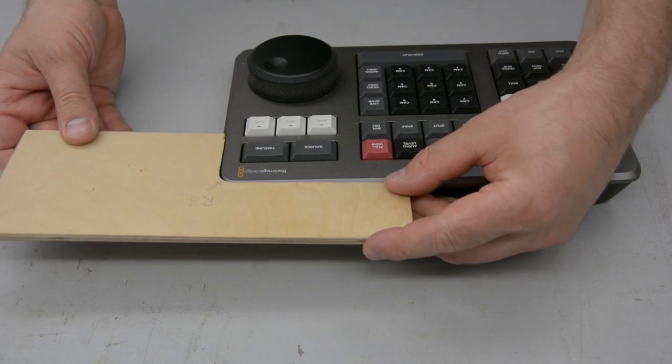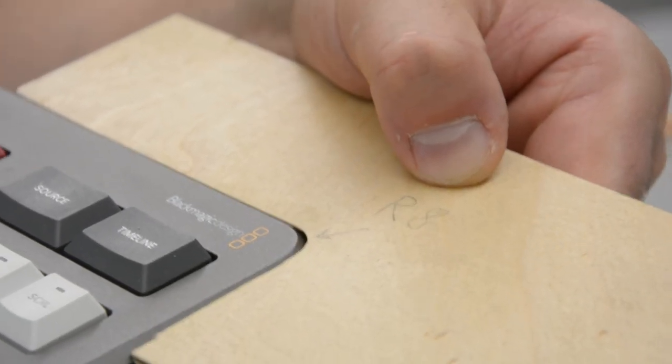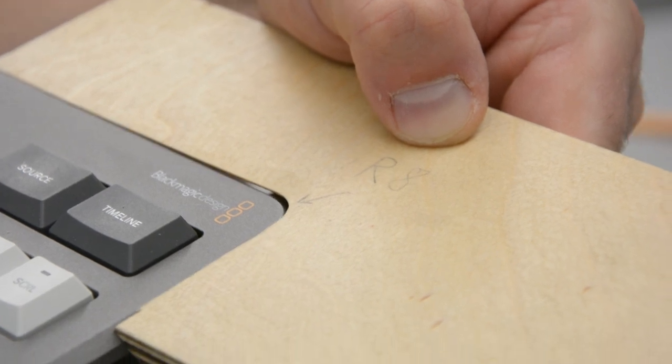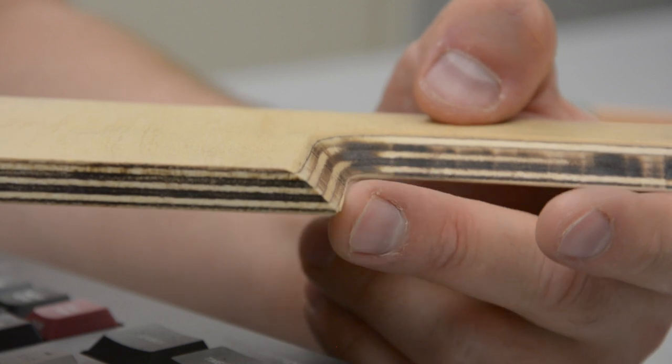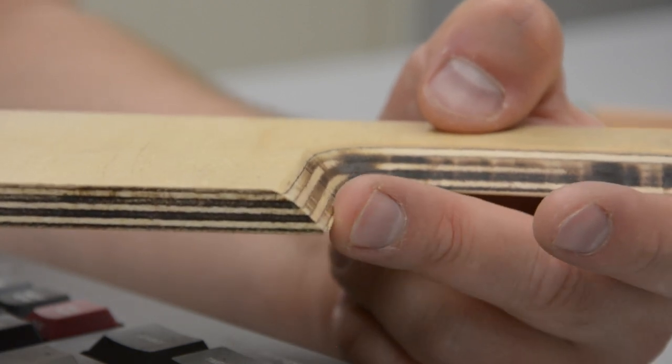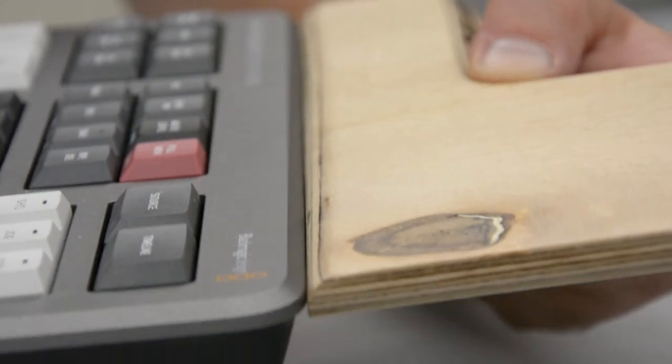The sunk chamfer cover mount looks weird. It is also quite hard to make, and even small imperfections are just screaming. The negative chamfer and the sharp edge is just a no-go. The fillet looks similar. The round over bit I have has an aggressive radius, and the exposed edges are just too wide and obvious.